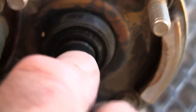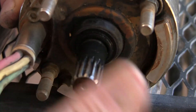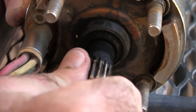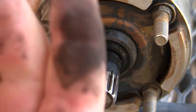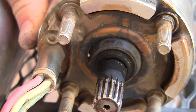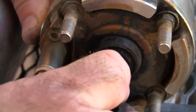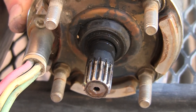Now I'm going to try to turn the shaft. Turn the shaft somewhat easily — it kind of gets bound up. Turning the shaft. When I pull it to one side or the other, it turns very hard. In fact, right there, I can't turn it at all. I'm pushing hard. I will use a torque wrench and measure the torque, but this is why it won't start in the hole. Pushing to the side, I cannot turn it, because the armature is rubbing against the field coils.